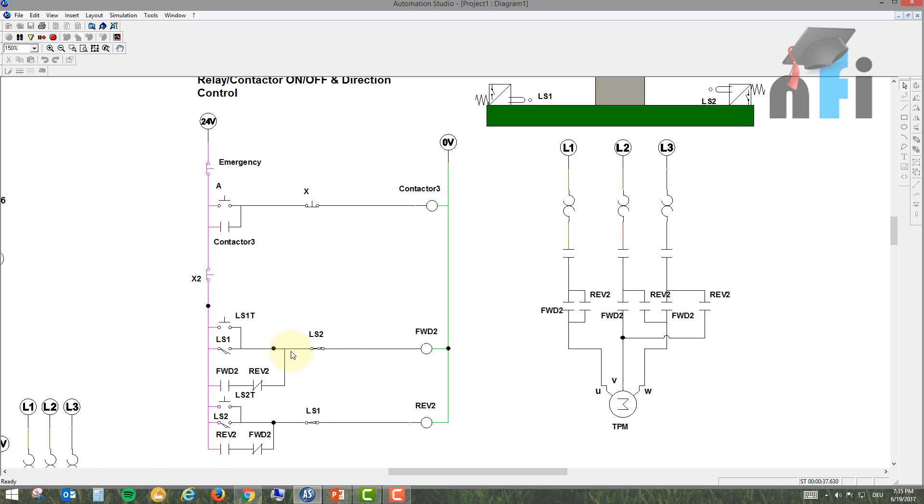This situation won't occur in normal operation, but if someone manually presses both switches simultaneously, the circuit remains safe. To do this, your limit switch must have two commons, two NO contacts, and two NC contacts. An alternative is to use extra relays with their NC contacts in series, but that gets complicated. Using the NC contacts of the limit switches directly is the easiest approach, keeping the main, forward, and reverse conductors protected.